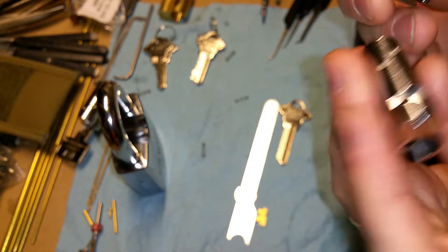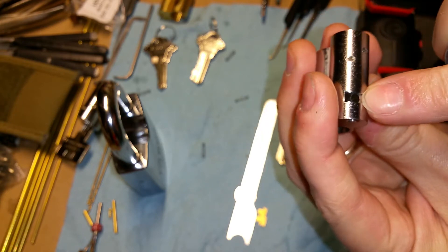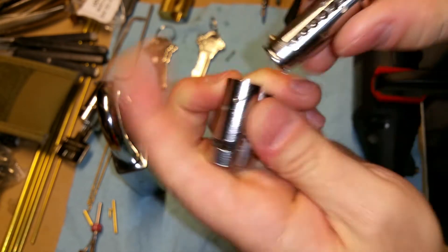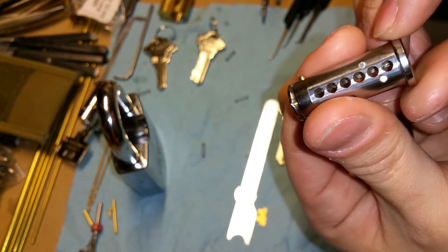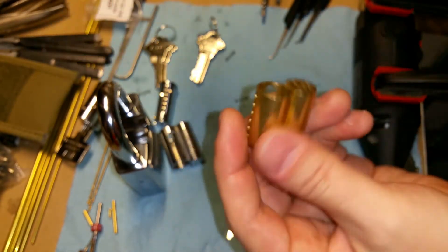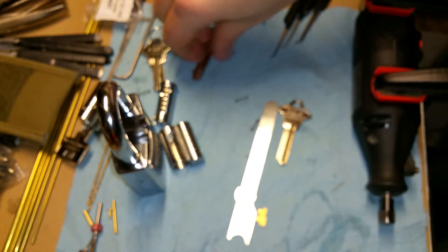The differences between the C6A 300 and the C6A 3000: it still has the open 6 hole, but on the core it's got anti-drill pins — two anti-drill pins in this core. That's the difference. The brass one with the C6A 300 is going to be the same as a chrome plated one, so you can see there's no anti-drill pins. Those are the differences — I went on a little bit too long about that.